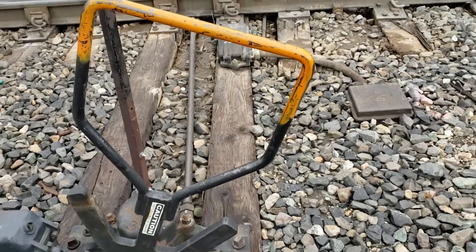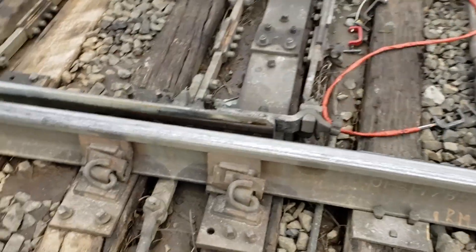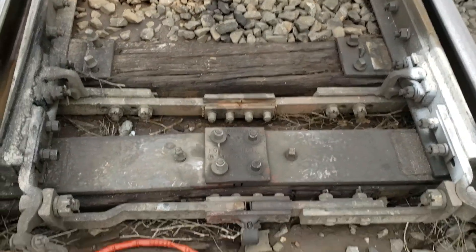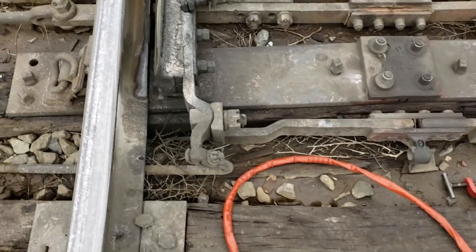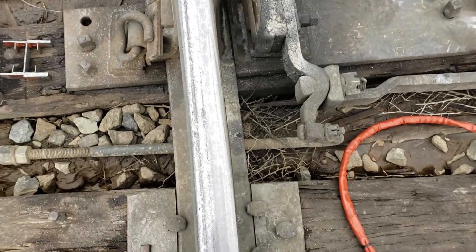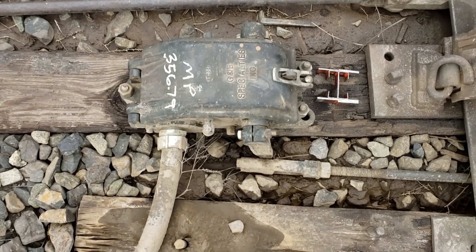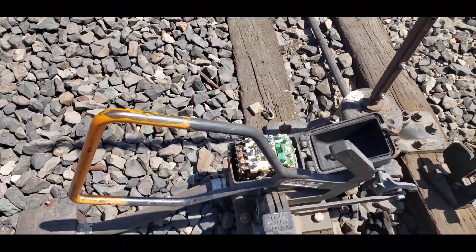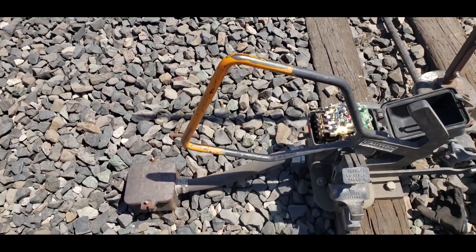I'm not going to throw that without jumping up and down on it. I told the track guys about that. That switch rod goes out here, attached to that switch rod there between the points — that throws the switch. This front rod here belongs to us; that one belongs to the track department — the throw rod, number two rod for the number one rod. And this one, as is at the power switch machine, has a point detector, and it is attached to this, which is called a U5 switch circuit controller box. I actually had to turn off my camera and return that to its normal position — this switch is very difficult to throw in either direction.